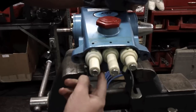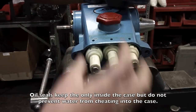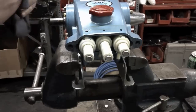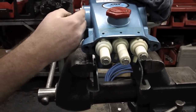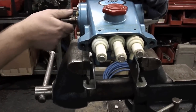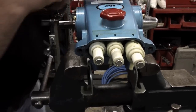Typically it's not a failed oil seal, because then oil will come out this way and not water back in. If you're using regular oil, that's fine except when you have that problem, because the water will go back into the case and the oil will rise and come out the top. If you don't see it, your cranks will continue to run in water, and that is very hard on them.